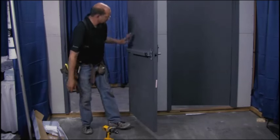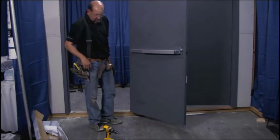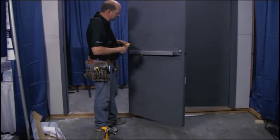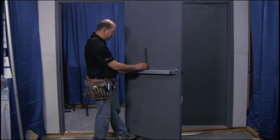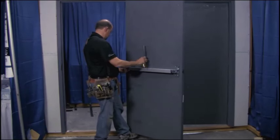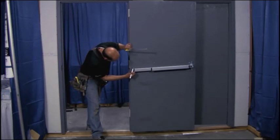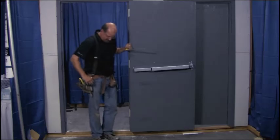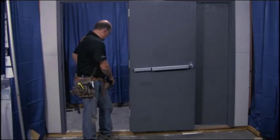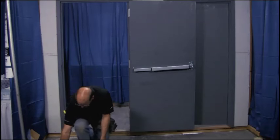Now we'll put the end bracket and the end on it. You can see it moves quite a bit, so you want to take a level — a lot of guys use a plumb level, I'll just use a little level in my square. Line it up, bring it up level, and mark it. When I mark it, I put my mark on the inside of the panic bar and onto the door so you can line that up later. You don't want to put a whole bunch of pencil marks on the door, especially if you're working on a nice pre-painted or wood door.